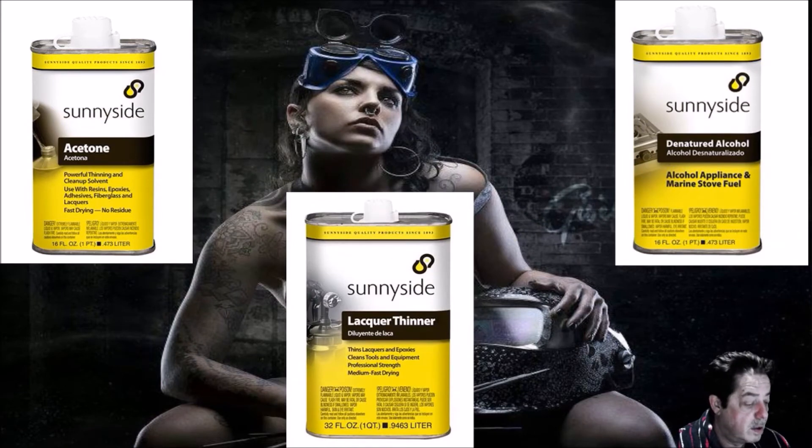Upper left — let's talk about acetone. I use acetone more than a lot of this stuff, especially when I'm cleaning steel and getting ready to put primer on it. It works great and I really like it. Use it in a well-ventilated area — I like it because it's very fast drying. After I've gotten all my nibs and stuff off the steel and it's fairly well sanded, I wipe it down really well with acetone, or I use a vapor mask. Because it's incredibly fast drying, you can almost start dealing with the steel right away, then go to primer, let it set, lightly sand the primer, and put your paint on. Acetone is my go-to.